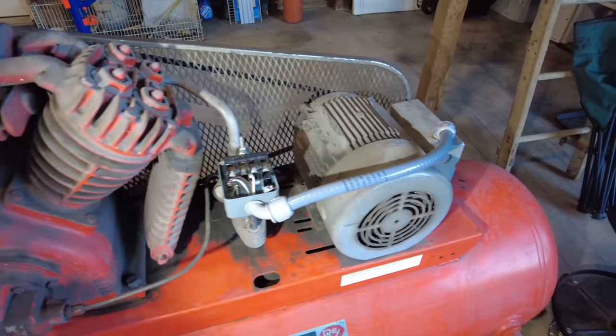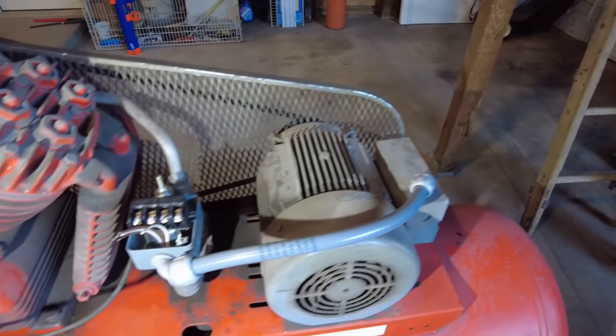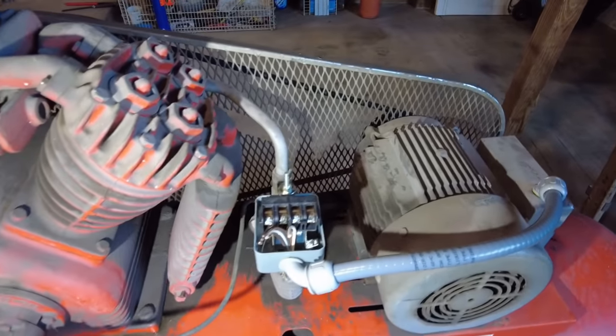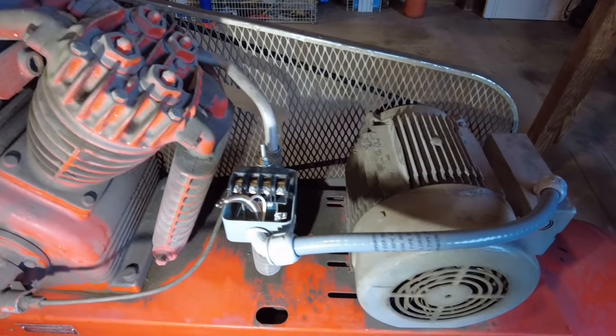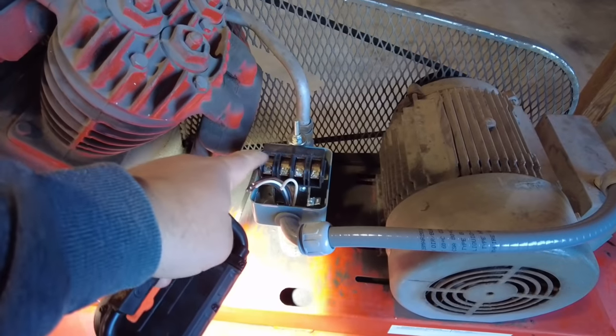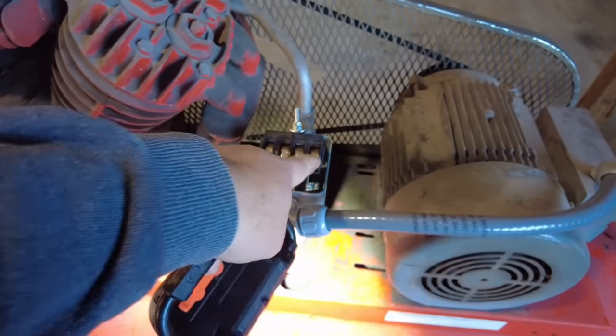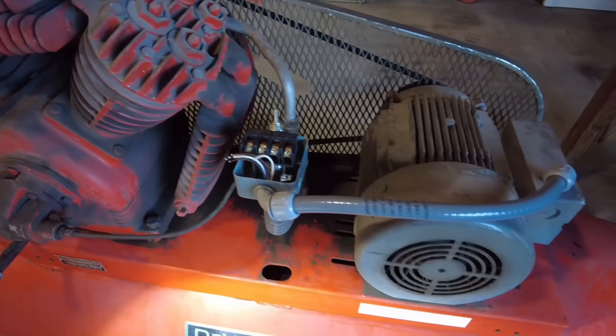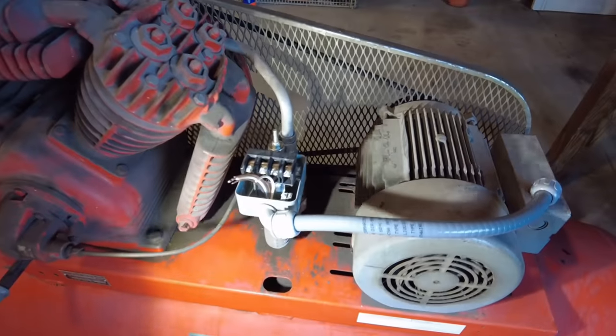So we've got from the pressure switch to the motor all ran. Now we're gonna have to get the wires put in on this section. We've got the middle two poles here go to the motor, and the outer two poles will go to the line from the wall. So we will do a second section after we get the compressor pushed back into place,